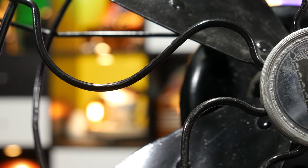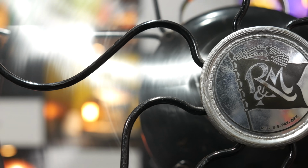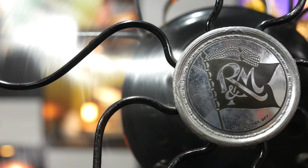After which point the rotor's movement relative to the stator produces the necessary currents within the rotor's windings to keep itself going, and we're happy. And yes, I am still oversimplifying. We'll talk about Fleming's rules and Lenz's laws when you're older. One of, if not the, simplest ways to create rotation with only one phase is with a shaded pole motor. Let's look at one. It's a good thing I still haven't put the selection accumulator back in the jukebox, because it's got one of these.